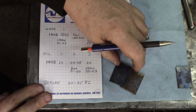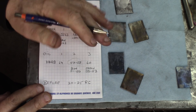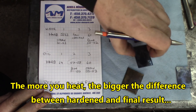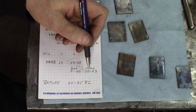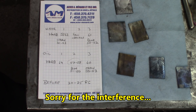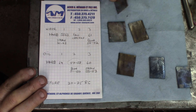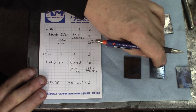Oil: number one stays our reference at 64. Number two — hardened 57-58, pretty consistent. Blue colored: 51-50. The more you heat, the lower this will get. Number three: hardened at 60, straw color 55-53 — two readings, pretty consistent. Some parts will read consistently and do pretty good. I would suggest if you want to work with bed frame stuff, use oil quenching for hardening. You could warm up the water near boiling point, or you could heat up the oil before the quench — that's another solution. Sometimes you won't get as hard on the hardening, but you will get less brittleness.